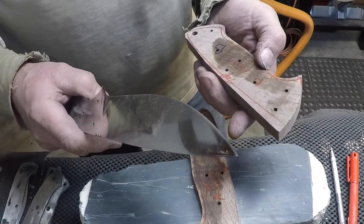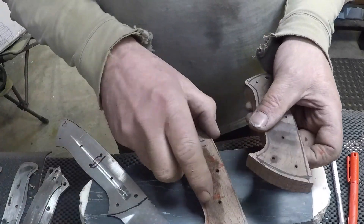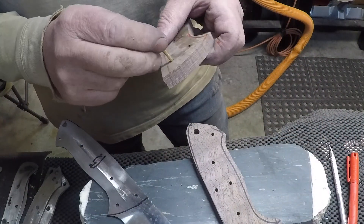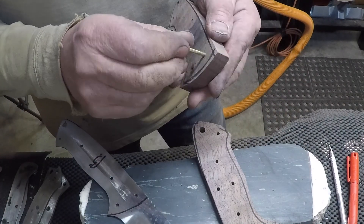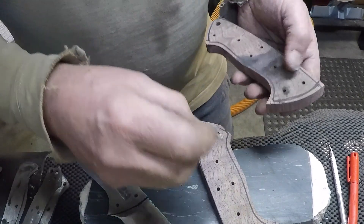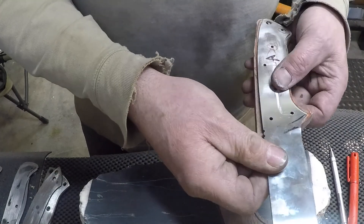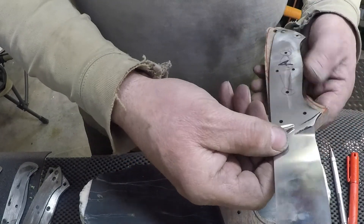I took it over to the grinder and took down all the excess walnut in the front. I used a 36-grit belt to get it here. I tried with an 80-grit but it just wasn't cutting it — a lot of work. Sometimes that's what you've got to do: change the belt, go to a brand new belt. You like to save money, but in this case that's the way to do it. One side's A, one side's B — you put the B sides together and you can start to see how things are going to come together.